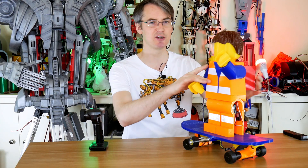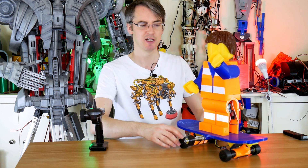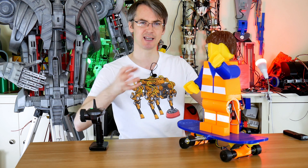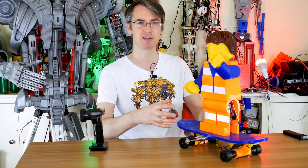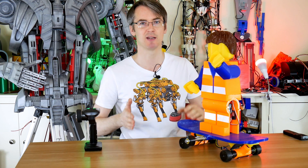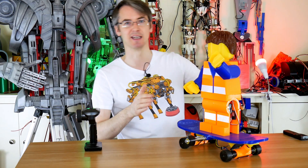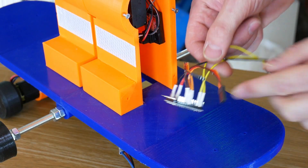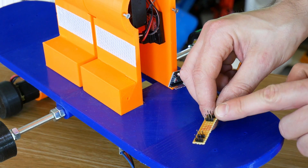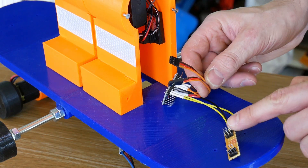So now it's time to actually sort out the steering. At the moment he just leans to steer and we hope that the board leans enough and he tries to steer with proper skateboard trucks, but the problem is that all the wheels are brushless and they're all locked together so those brushless motors tend to stay quite well locked together. We've got a separate motor driver so they can run at different speeds but they're actually all trying to run at the same speed which is going to resist the steering. So I'm going to build a system of differential drives — as we steer him we read that steering channel from the RC receiver and it makes one set of wheels go faster and the other slower. We've got an Arduino Pro Mini that's going to live in his leg here with the radio control receiver, it's got two wires that come in for the steering and throttle channels then it's got two lots of two that go out for the two sides, so we've got two ESCs on one side and two on the other.